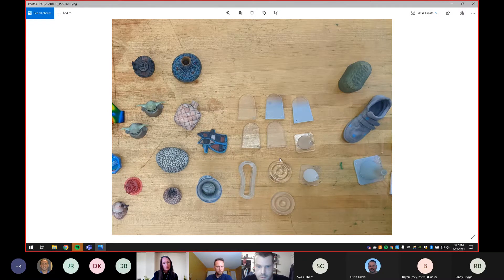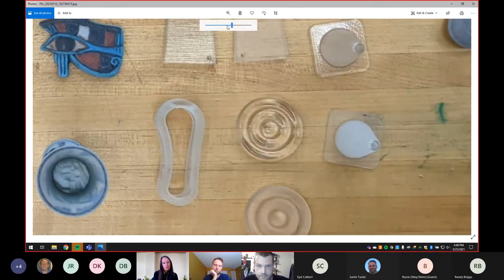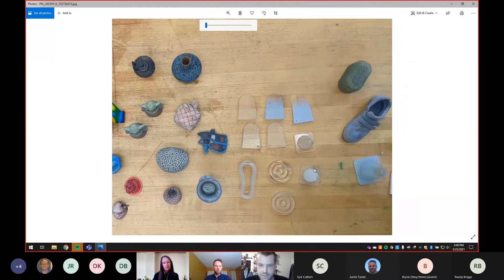This is me playing with color mapping onto an object where I wanted to fade a gradient from having color to being totally clear. I was able to do that by using a PNG with a transparency channel. I thought it came out kind of cool. This other model came out really nice and super see-through without any post-processing. Depending on the orientation, whether clear material was used, and whether printed glossy, you can get some really shiny, clear-looking parts coming right out of the printer without post-processing.